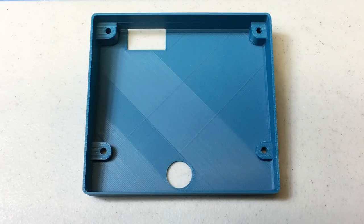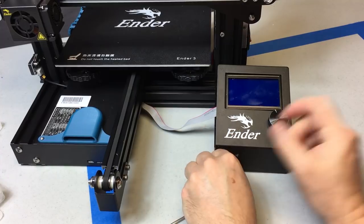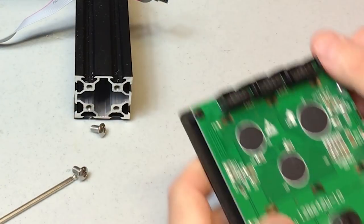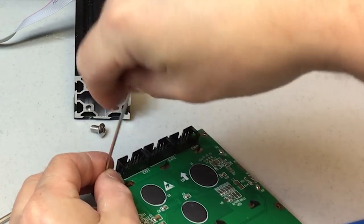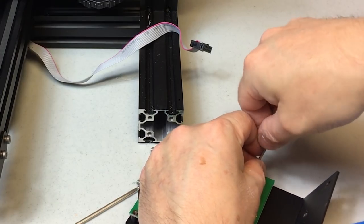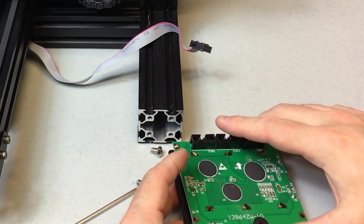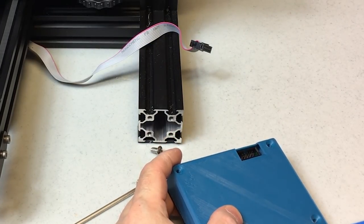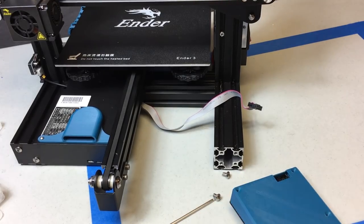Next up, we're going to put a back cover on your LCD panel. Print it at 0.2 or 0.3 layer height. Remove these two screws on the front of the unit and then very carefully unplug the ribbon cable from the back of the LCD screen. This LCD has four screws — one in each corner. Remove all four using the hex key that came with your unit. Depending on which cover you've downloaded from Thingiverse, some will allow you to use the stock screws; some you're going to need longer screws. They're always metric M3 by a certain length. I had to use M3 by 16s for the top two screws and was able to use the stock screws for the bottom two. I'll link the screws on Amazon in the description.